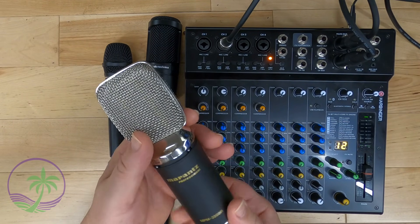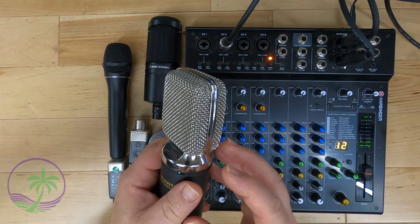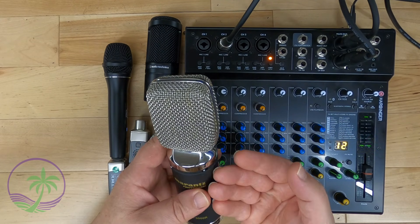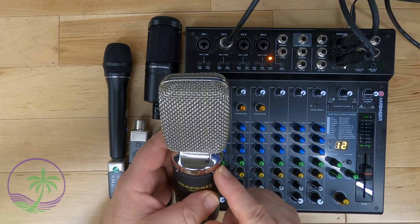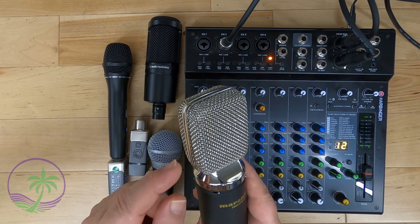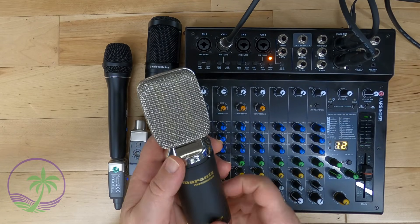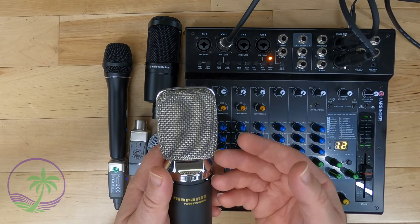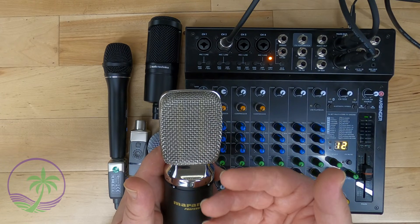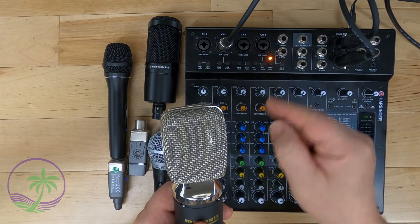But in this case, when you have a lot of these great new microphones — this happens to be an MPM 3500R from Marantz Professional — it has some built-in features, technology, electronics, and components that need to be powered to make this ribbon microphone be as good as it can be. It has the ability to increase or decrease the actual dB by 10, and on this side we have a high-pass filter, because ribbon microphones have a great tendency of generating a lot more low-end than you may want. So this does need phantom power for all these electronics. It's also a safe design — if a manufacturer knows their product could be harmed by 48 volts, it's better to put safeguards into the product so users won't have an issue if they accidentally turn it on.